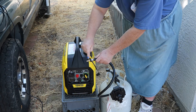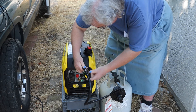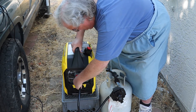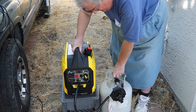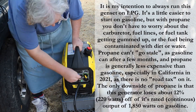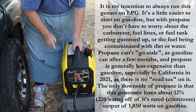Notice the little black plastic prong here that goes in that hole on the face of the generator — like this — and then you just push until the connection clicks and you're done. Turn the gas on, listen for leaks, and then to start you first have to prime the regulator and hose.